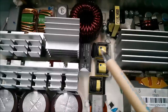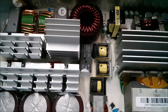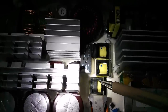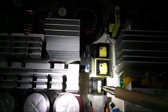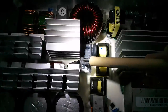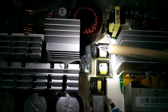This is a single output PSU, so why have we got three little inductors here? This one's slightly odd — it says 'tube' on it, so there's some sort of strap running over the top. Is that actually a conductor — a secondary to the primary underneath it? These two don't have it. And there's an NTC here and actually another NTC down in here — negative temperature coefficient inrush current limiters.